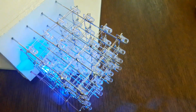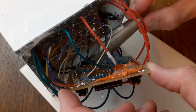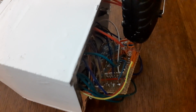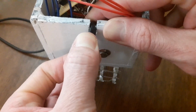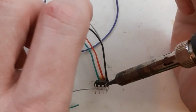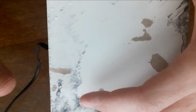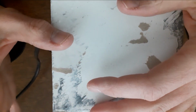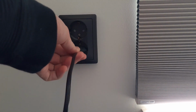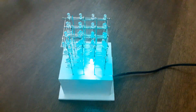Finally! After this it's time to close up the housing. But not before I've protected the bare contacts with some lacquer, using some hot melt to fixate jumpers and for strain relief, and gluing the grid cable into the slot, and finally also soldering some programming wires onto the micro. Finally I forcefully make the electronics fit the housing and close it up using some high tech. And then the moment of truth. After all is glued in place, I test and it still works.